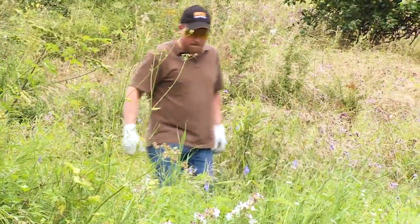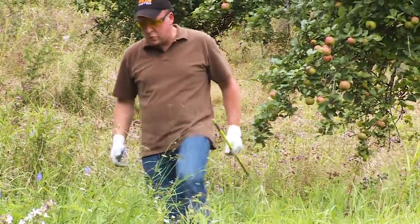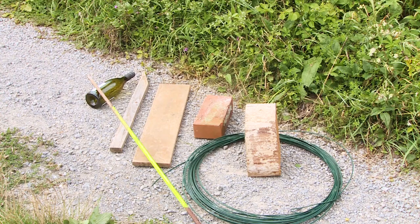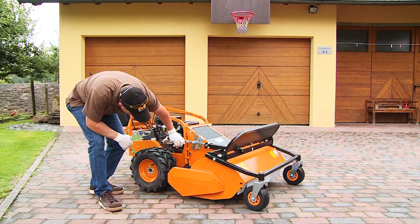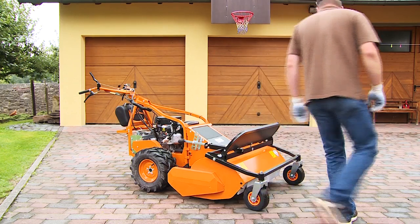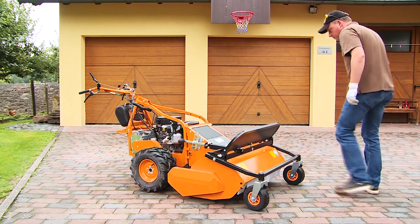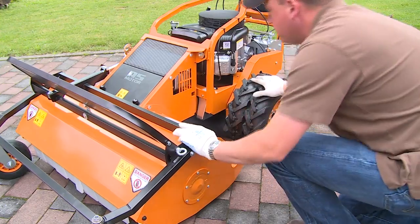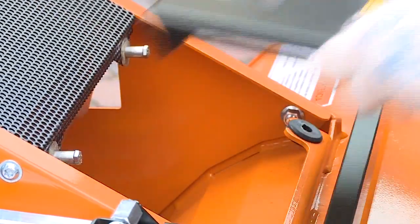The area to be mowed should be searched before cutting. Remove all objects which could disturb or become dangerous. Due to rapid flail rotation, any obstacles remaining in the grass may become airborne and cause serious injury. Before mowing, always check the mower in case of loose or lacking parts, performing all necessary repairs. Protection shields must all be securely fastened as they are meant to keep you and others safe. They must not be repositioned or removed. Never use a machine without covers, shields, or any other working safety devices — they are installed to prevent the possibility of injury due to airborne objects.